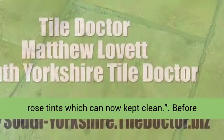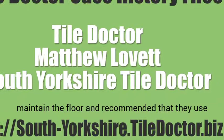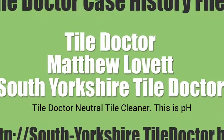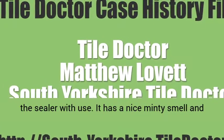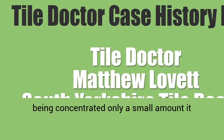Before leaving, I discussed with them the best way to maintain the floor and recommended that they use Tile Doctor Neutral Tile Cleaner. This is a pH neutral tile cleaning product which won't harm the sealer with use. It has a nice minty smell, and being concentrated, only a small amount is required.